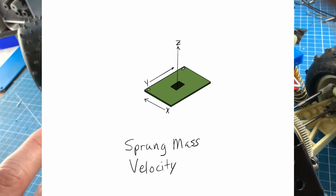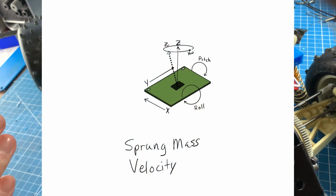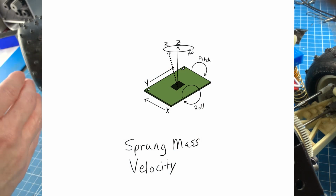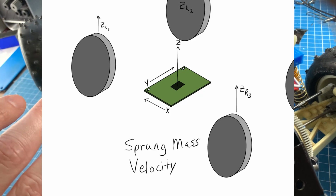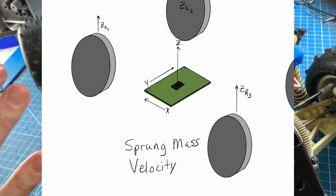I'm not sure if I can use the vertical displacement directly from the accelerometer, since it'll be mounted in the center of the chassis, or if I will need to work out a relative z velocity vector in relation to the absolute level from the gyro data, or I might even possibly need to come up with some component vectors for each of the sprung masses for each of the wheels. I'm not sure. If you all have any ideas, let me know what you think.